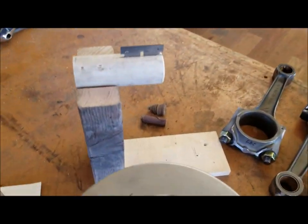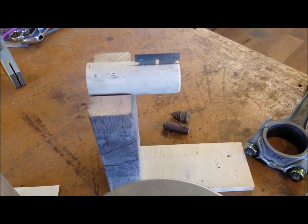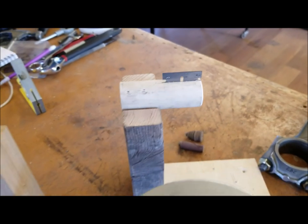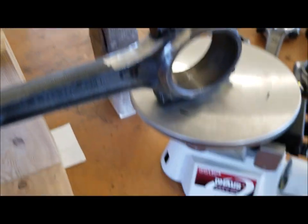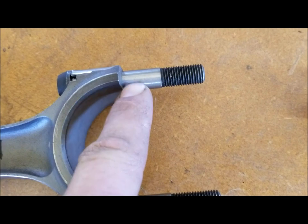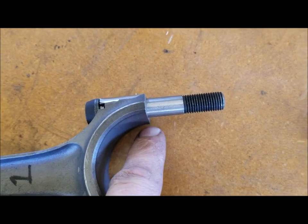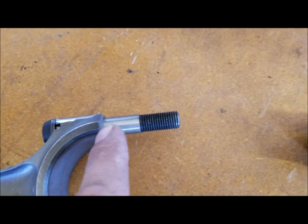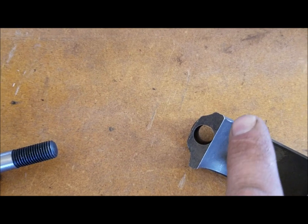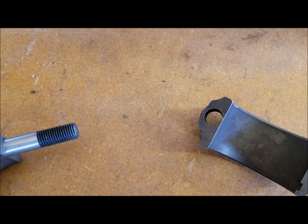When I switch over to the other side, it's a little bit taller because I needed to keep things level. You'll see that the pivot point is that razor blade there — it's been leveled. The pivot point on the rods themselves is right at that edge. I've taken a light file just to get rid of any sharp edge there, and that light file between that side and the end cap gives you just a tiny groove that the razor blade sets in. That razor blade is my pivot.